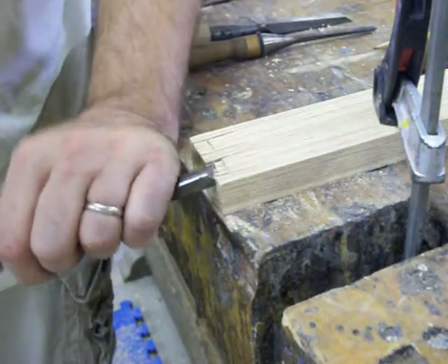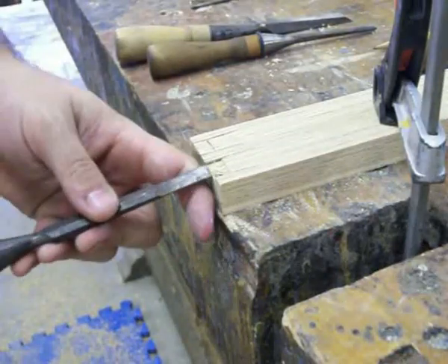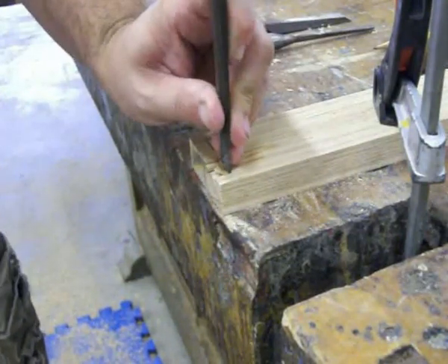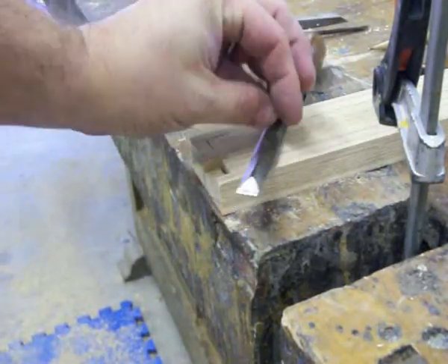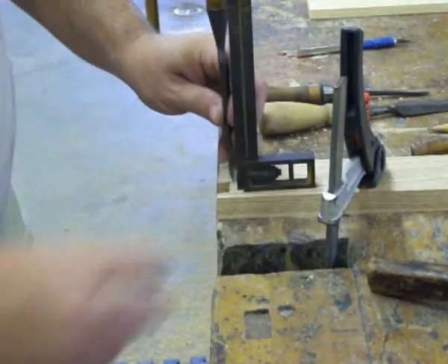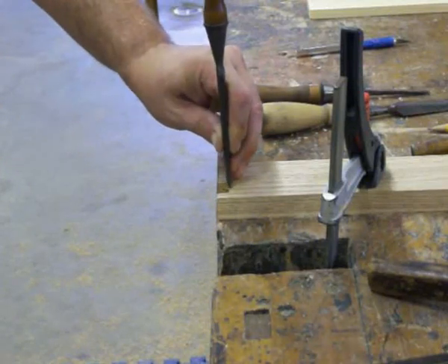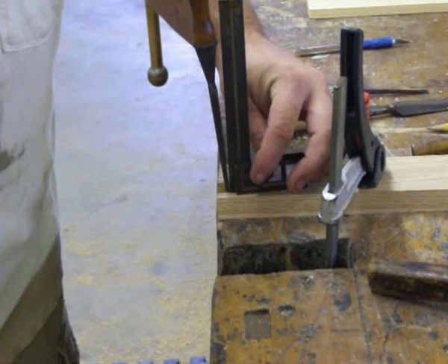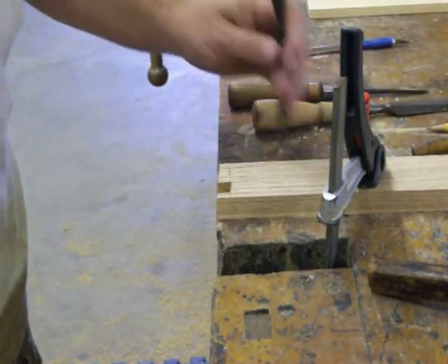Now we're ready to start chopping out the waste with the chisels. I've made a driving cut on the flat grain and I'm just trying to take out as much as I can towards the end grain. I angle the chisel just slightly underneath the tail so it doesn't break out the tails — if you cut straight in flat you have a tendency to pop the edge of the tails out. On this half-inch chisel I've taken and run it through a grinder and kind of knife-edged the edges; that helps get in here a lot easier. When I'm chopping down from the scribe line I like to pull the chisel out just a little bit to give it an undercut. That makes the tail board set down in there easier. This is a little exaggerated but just a two or three degree angle is good enough.